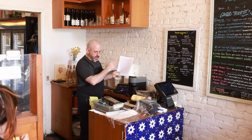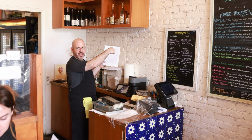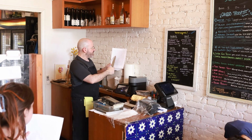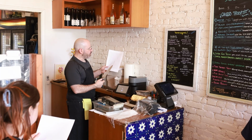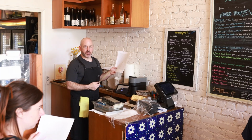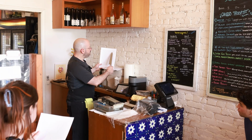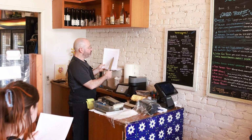So here we have a cross section of the knife. So imagine the knife is just coming through the paper like this. When our knife is dull, whether it's chipped or something like that, this is the base area where we're beginning our sharpening. On our first stone, whether that's our coarse stone or our medium grit stone, we are going to sharpen on the first side at whatever angle we choose, which we'll talk about in a second, until we form a burr.